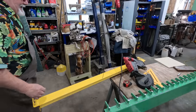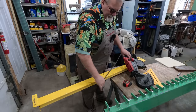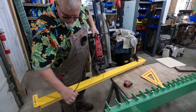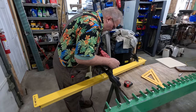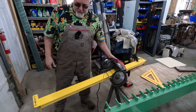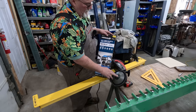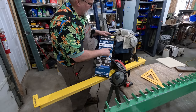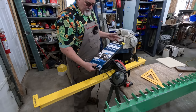All right, we're back at it again with the old bandsaw. Now, this is some really thin metal. It's amazing the strength it has when it's in place as a pallet rack, but it's very thin. And I'm using a very fine tooth blade here. They come with several blades. Let me show you. This isn't what's in here; I got a finer blade than this in here. This is a coarse one that's for stock quarter inch and thicker. If you go to the store, I'm buying the bimetal blades, they last the best.